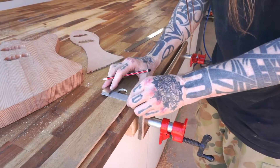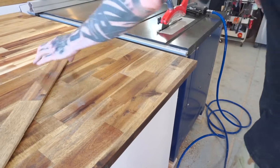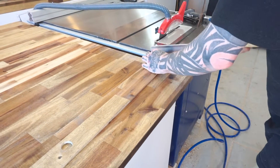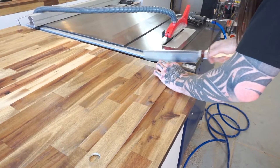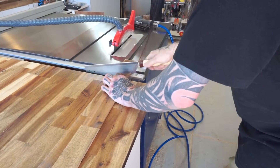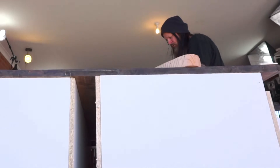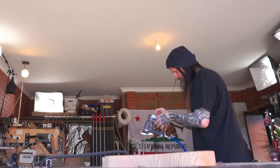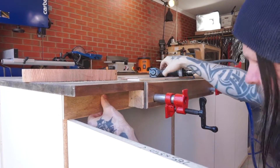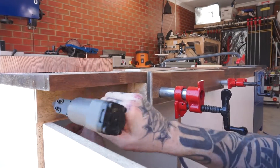I'm going to lose the piece in the middle. Once they're marked out, I can use the cutting gap I left between my outfeed bench and my table saw — this is unbelievably handy and much healthier than standing awkwardly next to a workpiece you're cutting unsupported off the side of a bench. Because the veneers are so thin, I'm not even using glue, so I'm just loading up the pin nailer, placing the veneer, and popping some pins in there. The job doesn't require five pins per side, but I think we all do it.